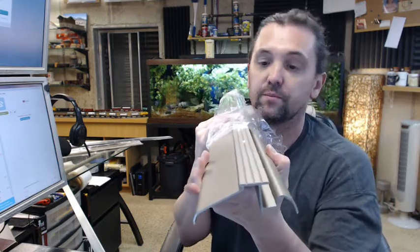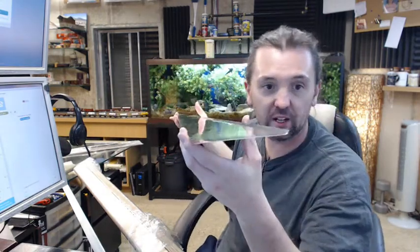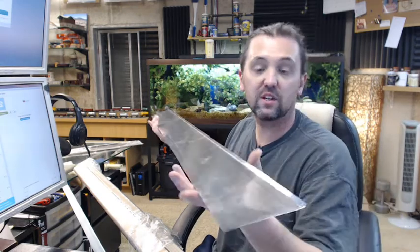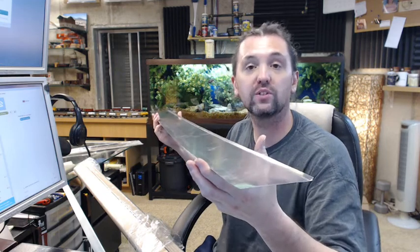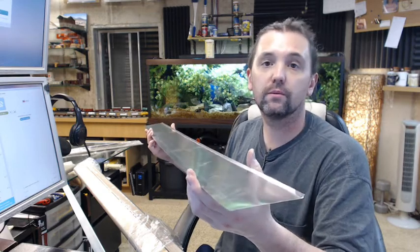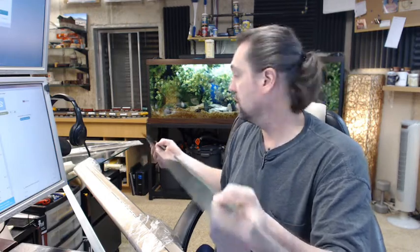Very effective. You can also get with this, and it is an option, a water pan. I'm going to show that to you now. This is the aluminum version of the water pan, and this client ordered it. And all it is, is a piece of aluminum that sits on the sill before your threshold goes down and simply acts as a barrier to help retard any sort of premature failure or fatigue to the sill because of a water situation. The material is so inexpensive when you add it to the cost of the threshold that if you decide not to use it, you can discard it or use it for something else. I say always get these.